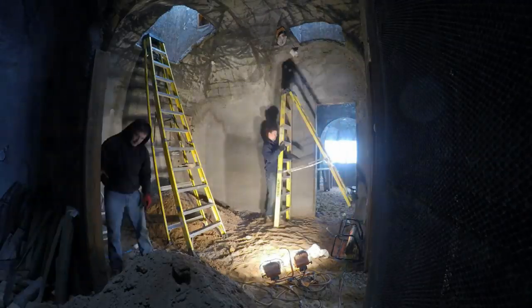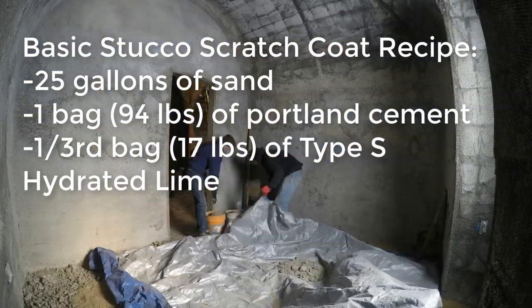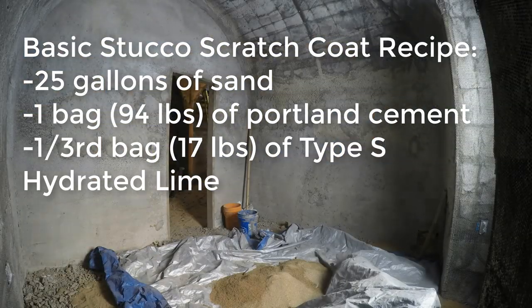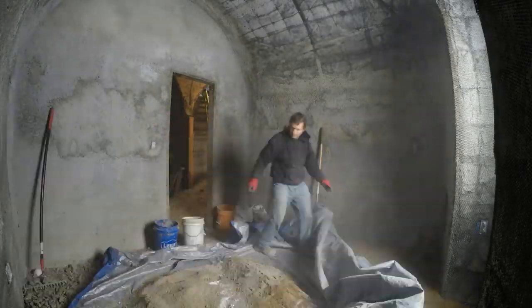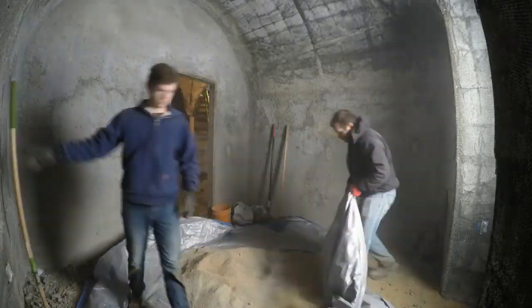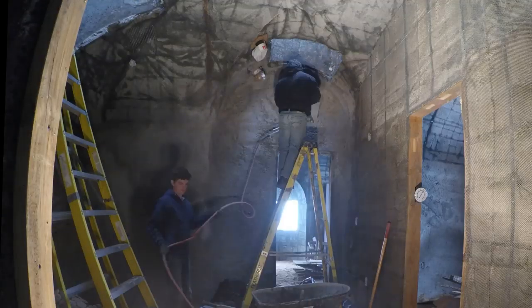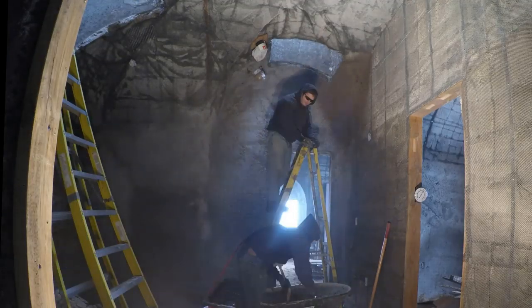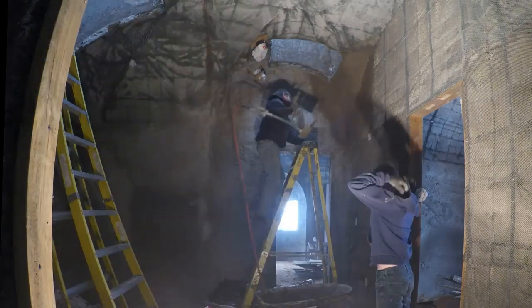When they buried the place, we had them dump some sand down the skylights to use for filling the floor and for making stucco. We'd take five buckets of this really nice sand and mix them with a bag of Portland cement and one-third of a bag of lime to make our own scratch coat stucco mix. We'd use a rake to mix it and a tarp to flip it, making about seven or eight buckets worth — each bucket was just the right size to mix in a wheelbarrow.